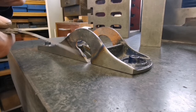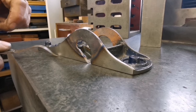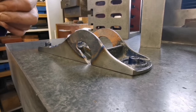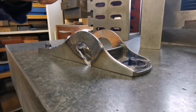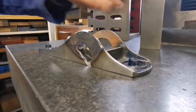So when we apply the warmth, we'll have a discussion on how much shim to put in, but I mean that's 1.5. So it probably only needs a couple of thou. Well, it's 3 or 4 thou because you'll get the spring back on whatever bit of shim you've added. And then we'll have a guesstimate of how much to over pack that to.